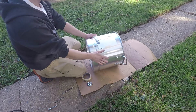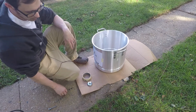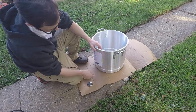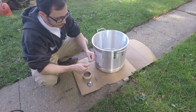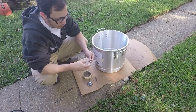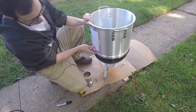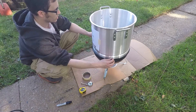I've got the stencil in here kind of where I want it. I want to make sure that I don't put any of my holes around there. We need to look into the grate holes, so we need to measure for those. We also need to measure for the heat deflector, and we need to measure for the drip pan or water pan. I want to have a space for both of those separately — I don't want to combine them and I don't want to stack them directly on each other. I'm going to do three holes each — there, there, and there.